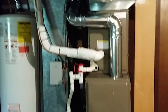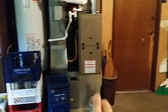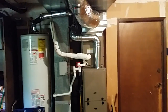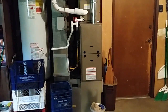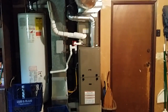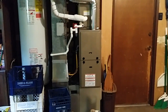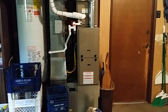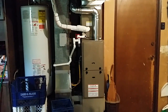Looking at this install — I'll show you upstairs — this is your basic setup. If you have something like this in your garage, you have your 4-inch filter cabinet, your base can, your furnace, with air pointing up. One of the things that happened in this install is they had about a 120,000 BTU furnace. The garage was hotter than the house — it was insane. Knowing we were going to be sealing that up and that we did Aeroseal on the duct work, we reduced duct leakage by 92% in this house and gained back a ton of capacity. We went down to a 60,000 BTU furnace.